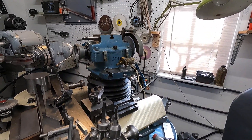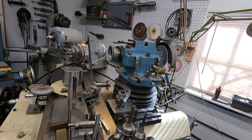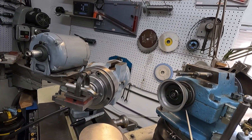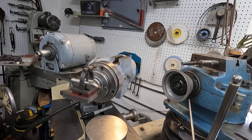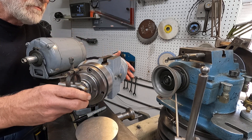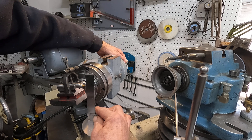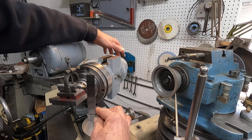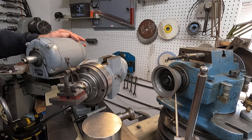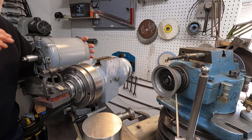I'm going to get this mounted up and get you a little bit of a bird's eye view into the cutter grinder. I'll get this set - one thing I'll quickly do is see just where that tool happens to be right now. It is seven and a half degrees clearance, and I kind of like that clearance for that tool, so I'll lock it in there with that little knob.